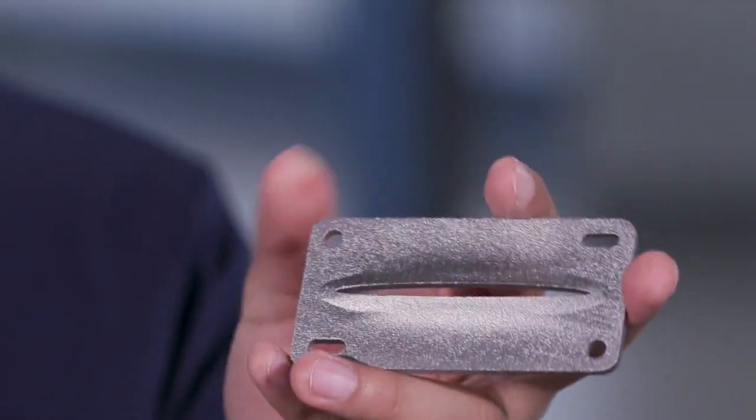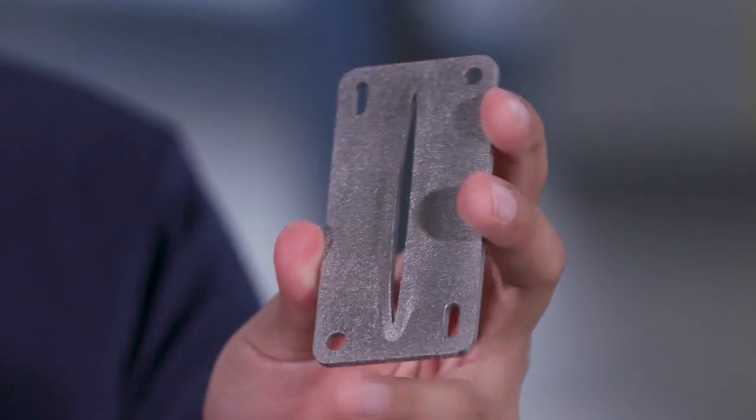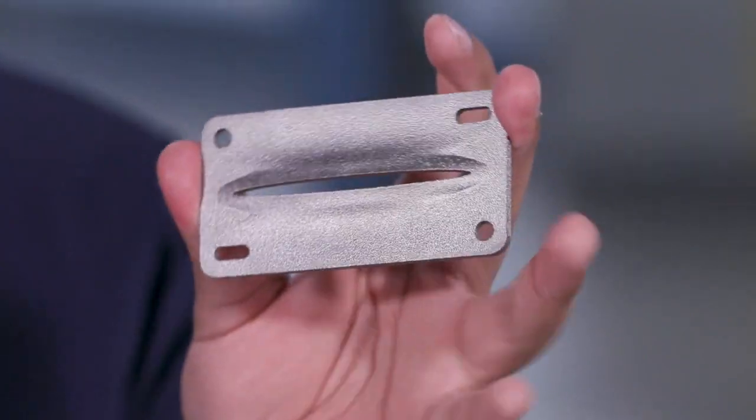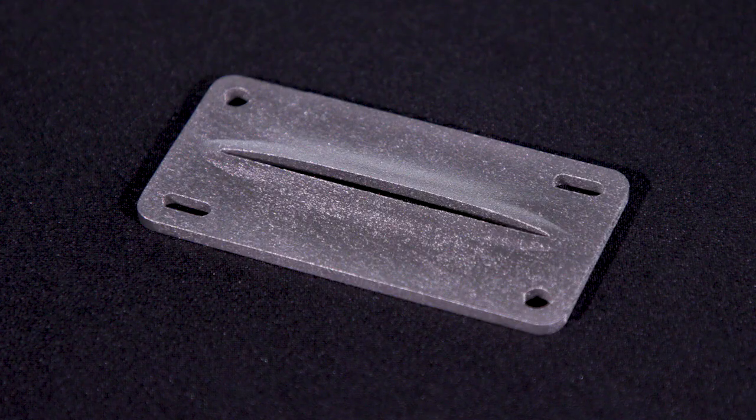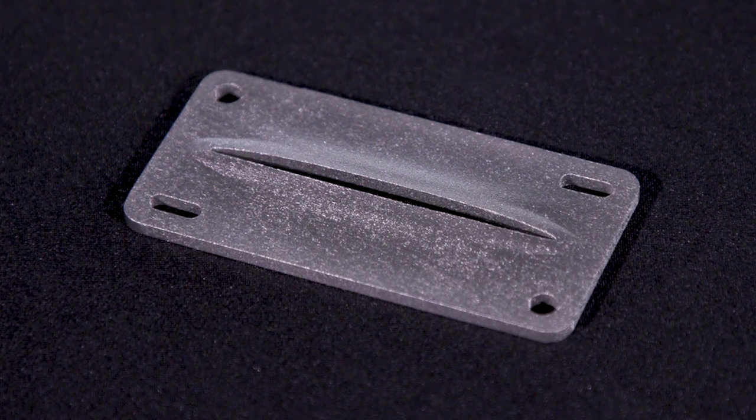Recently, the AIG has gone through substantial efforts to revamp some of our parameters for different applications. We've greatly improved the surface finish, we also have thin wall parameters, and all that has culminated in us now having a certified tungsten parameter set. We first printed this in 2012, long before a lot of other people, and we have a lot of industry knowledge around this specific metal.